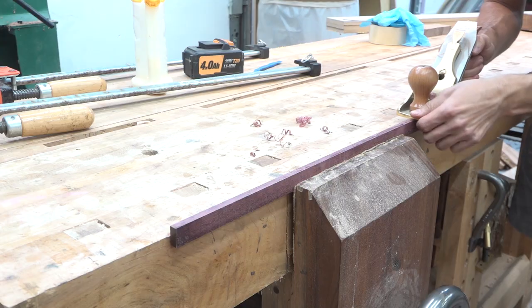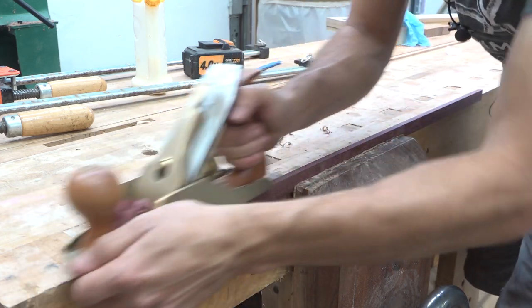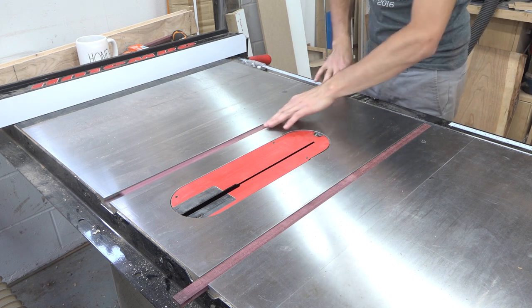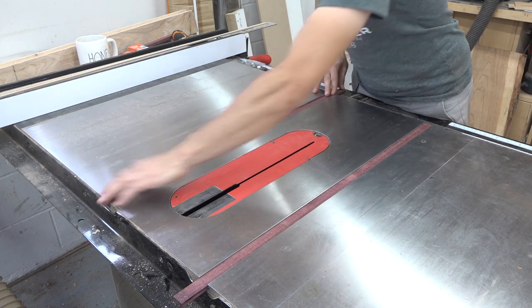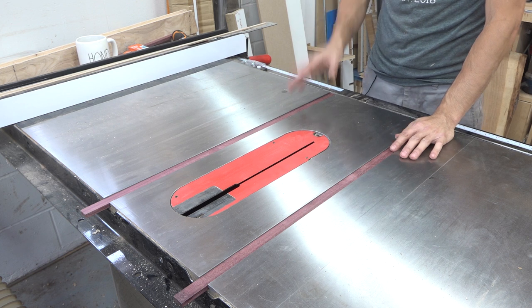The first thing I'm going to do is fit my runners so they go in a little bit better. I'll take them over to the table saw and give them a light pass with a hand plane, just until they fit down into the miter slots really nicely without binding up. This slides pretty nicely right now, and I can always fine-tune them once the whole thing is assembled.